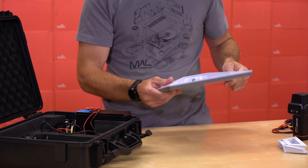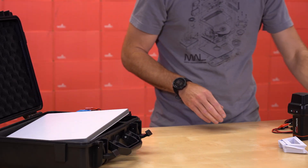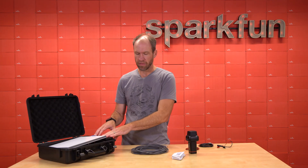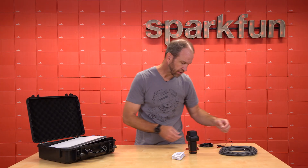One of the pitfalls I hit early on was using the original Starlink cable. This cable is about 30 feet long. If you hook up an approximately 12 volt battery across that 30 foot cable, you have enough voltage drop that the terminal will go into a brownout and constant reset loop — it doesn't work. So you cannot use this cable with a 12 volt battery.